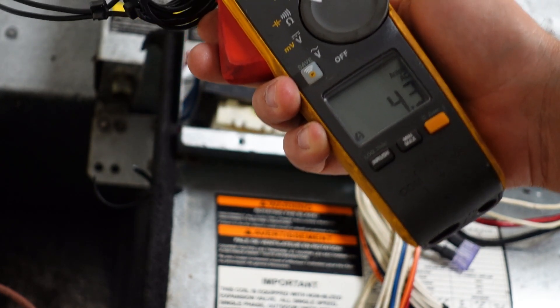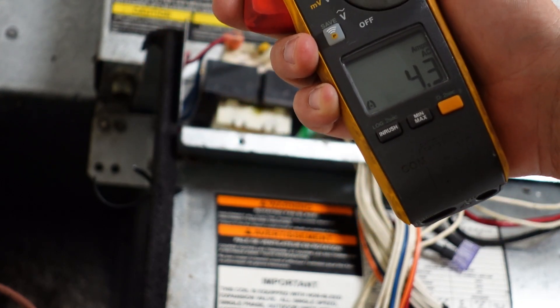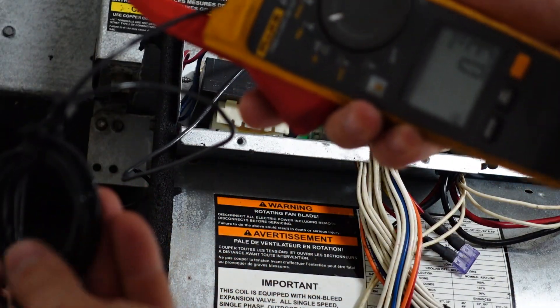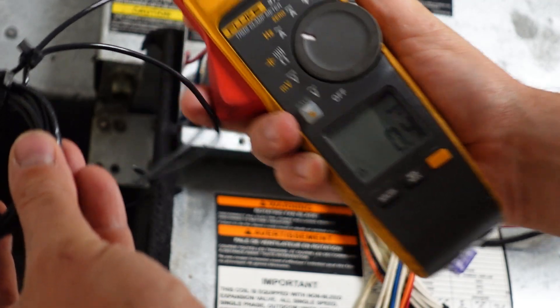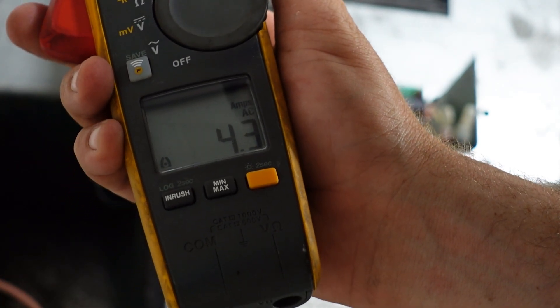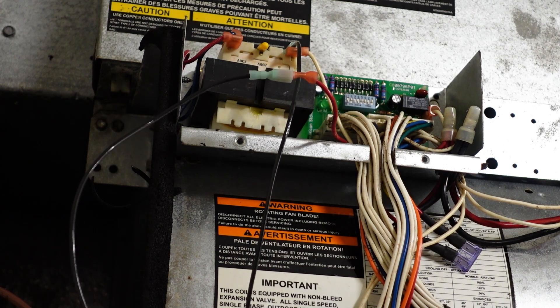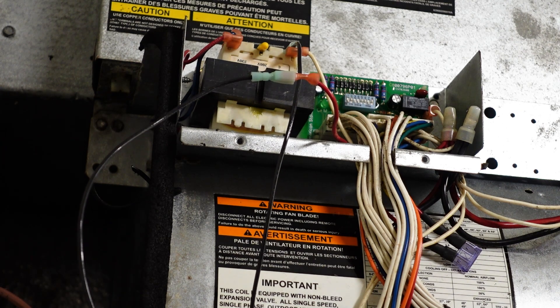You can see on the meter here we're drawing 0.43 amps, even though the unit is idle. We would move that decimal point one place to the left, and that would equal 0.043 amps right now. If you look at what the meter would normally say, it's reading from 0.3 to 0.4, but on our 10-wrap we get a true reading of closer to what it actually is. You could use that in your low voltage control circuit for diagnostics anywhere you need the resolution that your meter doesn't regularly provide.